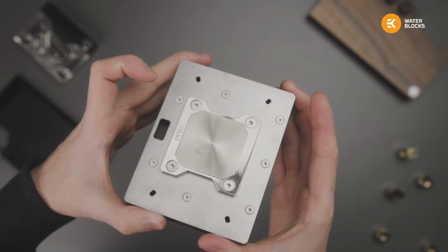That logic extends through the whole thing, so the cold plate is also specific to the socket, and they all have their curvature machined, so they're turned in a lathe with a very slight radius, like several meters, so a really slight radius. This helps the center to contact the IHS nicely where it matters. Chiplets are typically in the center on Intel, and for AMD they actually have a geometry machined into the opposite side of the cold plate, so where it's pushed down, it meets the area where the chiplets are first.